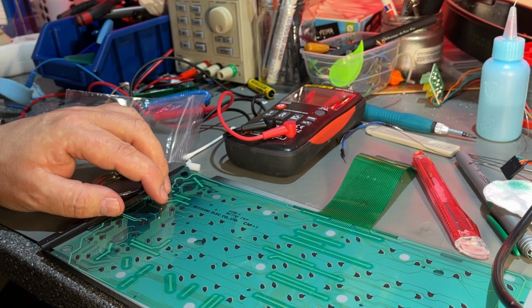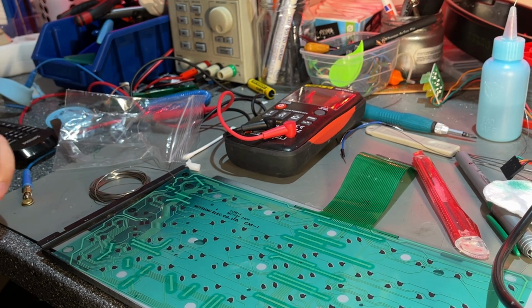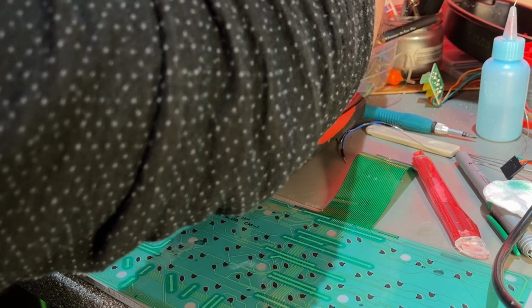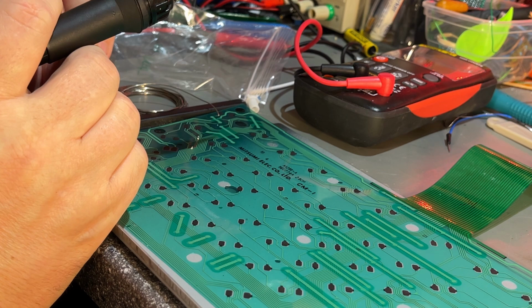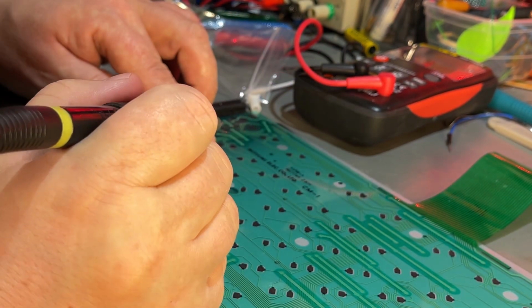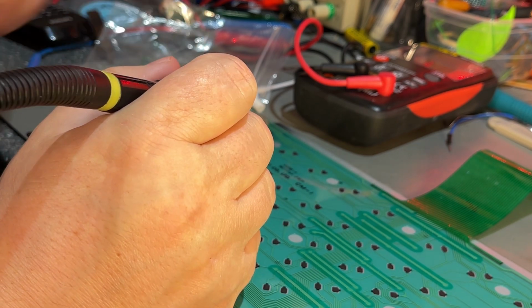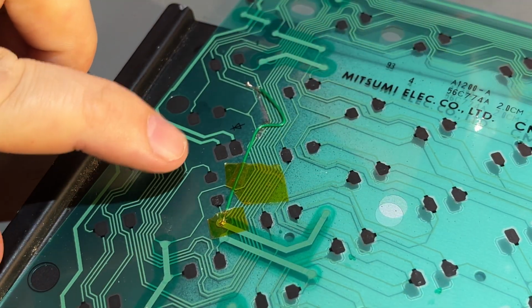All right, there's two blobs of solder there, and they're sticking. Let me try and use a little tin wire here. I only have like 280 degrees Celsius here. Oops, no, that came loose. So that solder did not stick. Okay, I think I have fixed it.